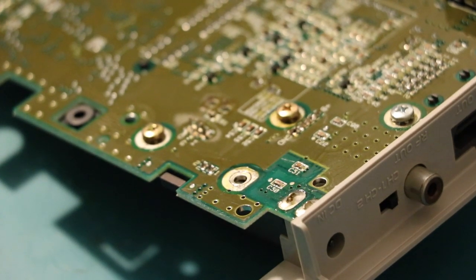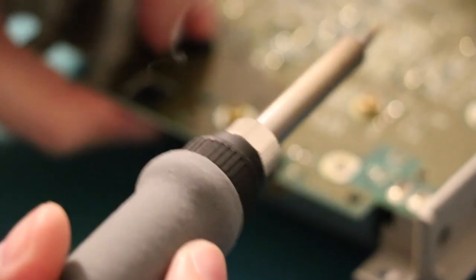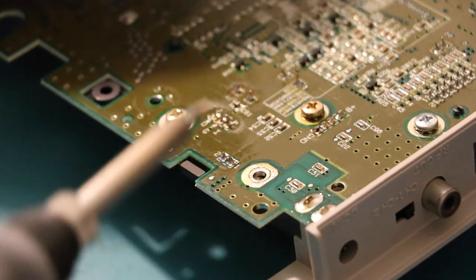Just got to remember to come back to it later and put some thermal paste in, which obviously whoever last worked on this one did not. Okay, so solder. Carry on.